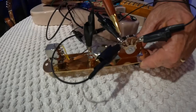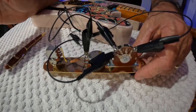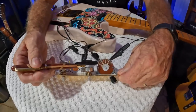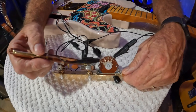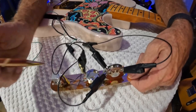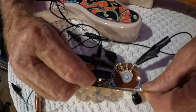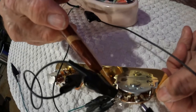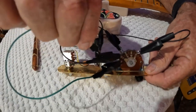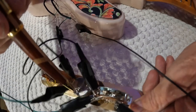You come from this switch to this first lug on your volume. You've got a wire soldered from there to your tone - that's your switch wiring. The only other wire you're going to put on there coming off the switch is going to be a ground. A lot of people wire their bare and green together and put them all in one place on the pot. You can ground here, ground there, ground down here or up here. We're going to come off this little lug right here on the side - you can see that runs through, touching this metal, which touches this metal, so it's grounding. We'll end up soldering it to the top of this volume pot.